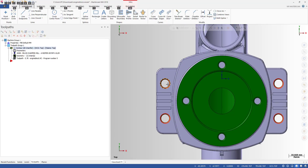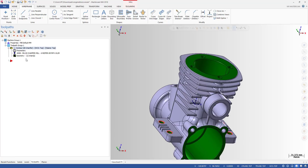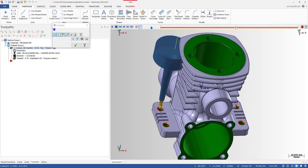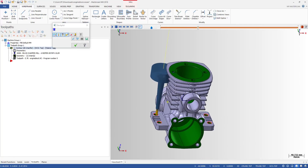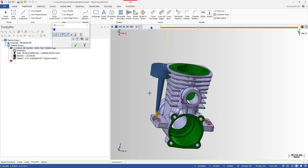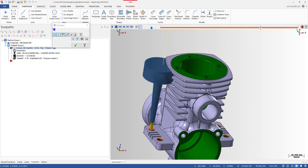There's one key issue: we have a very high wall here. When you look at the part from the top, the holes are very close to the wall. When you try to make a chamfer contour toolpath, you are unable to find a long enough holder — the part is too high for the holder, causing collision. You simply cannot find a long enough tool to make this chamfer.